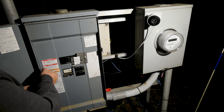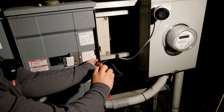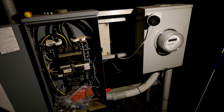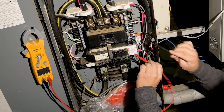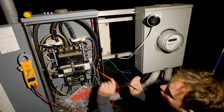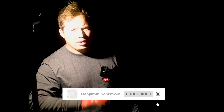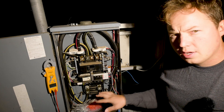Now I'm going to take this panel cover off. This is essentially going to create the situation where I would have the ability, if I wanted to, to turn on the utility at the same time as my generator is turned on — we're not going to do that — but just understand by removing this, I'm removing this safety measure. Here we are inside the panel. You can see we've got our Sense energy monitor down there, and the Sense energy monitor clamps up at the top. In theory, we should have 120 volts on each leg of our breaker right here that is coming from our power source. Let's go ahead and test that. Test from our first hot leg to our neutral slash ground bar — 120 volts. Let's check the other one. So we're getting 120 volts in on both of them. If you found this video to be interesting so far, I would really appreciate it if we earned your subscription and click that bell to turn on notifications.